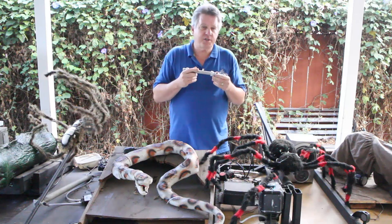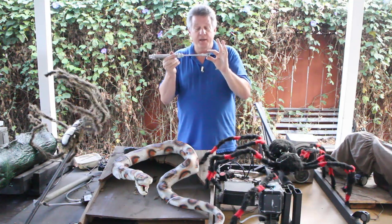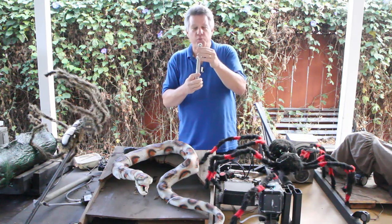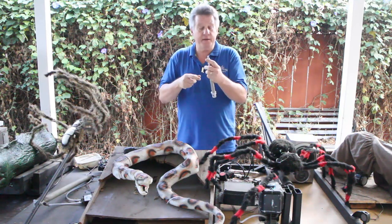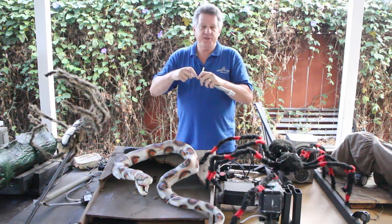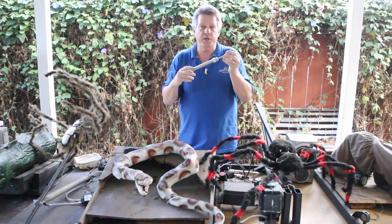If you don't have the ability to make them, make sure you pick up some mounting brackets. You're also going to need some way to connect the end of your rod to your prop, so there are all sorts of rod ends you can get. The end is threaded, so you can put a stop nut on here and then thread a rod end or clevis of some kind up onto the end, and then adjust that length — it gives you a little bit of adjustability to dial in your prop once you get it built.